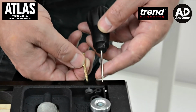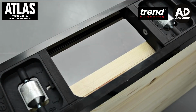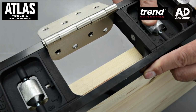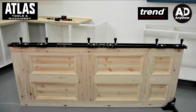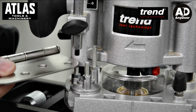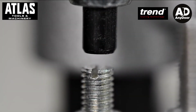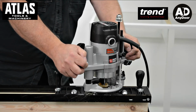The blocks can be secured with the supplied bradawls or wood screws. Use the hinge to set the correct length, bringing up the second block and tightening off, then securing with a bradawl or screw. Set the leaf depth by zeroing the cutter to the door edge and using the turret stop. Route each recess and remove the jig.